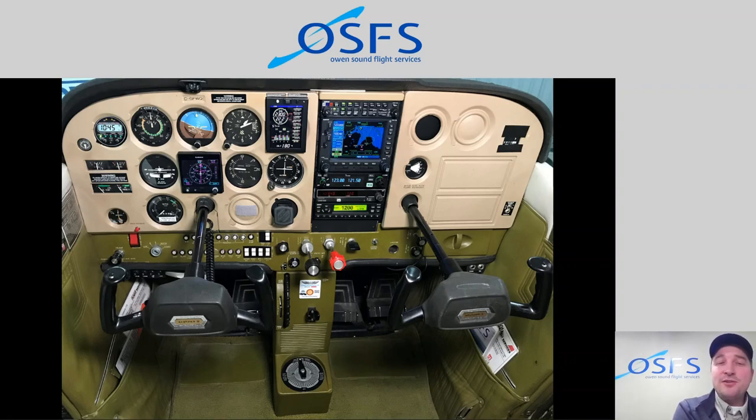For some different scenarios, I usually have different things indexing. So when I'm climbing, I might have auto indexing of temperatures, CHTs and EGTs. And when I'm on an IFR flight, I might have auto indexing in the fuel flow mode to show me the range and fuel to destination, fuel remaining at reserve at landing, and that kind of scenario. So it's customizable to what you want. And especially if you have less linear gauges, you may want to take more advantage of the auto indexing mode. Otherwise, you might just set it to a specific one and monitor that.